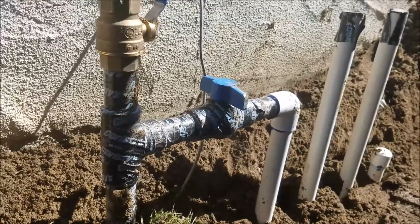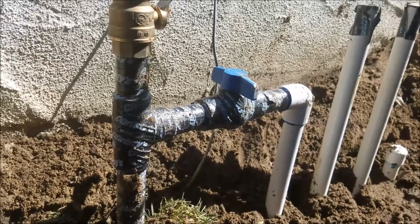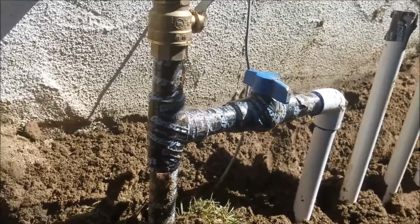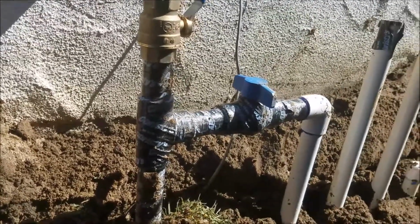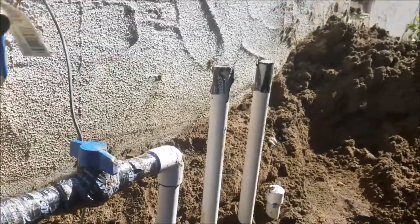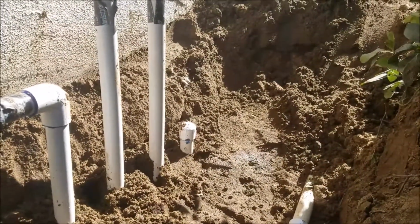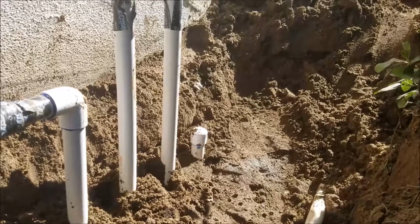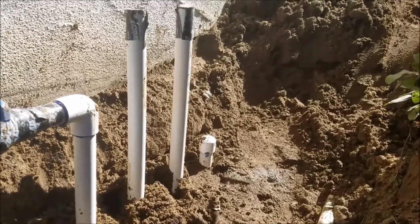And sometimes things get broken, and I understand that, but in this case, I don't want to work on this again. It's a solid installation, Schedule 80 pipe. It's got a T in there and a shutoff valve. What I'd like to see is have your sprinkler guy come back in, get his 2 manifolds on there. I gave you a separate one right down there. You can see it's stubbed low in the event you want to do a drip off of there. You certainly can. It's capped off because it's a live pressure line.